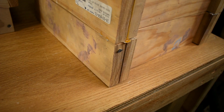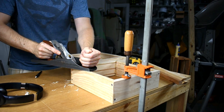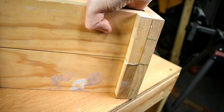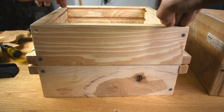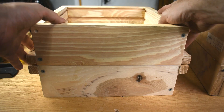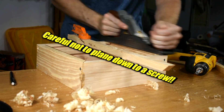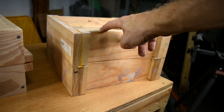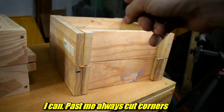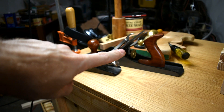Next, to fix the sitting-flat problem, I made sure the bottom flask would sit flush on the table — just adjusted it with the hand plane. Then I did the same thing to make sure the fit between the two flasks was better. Not only does it not rock on the table in either direction, the top doesn't rock on the bottom either — they fit perfect. I had to do this at the building stage, because as soon as you use it, sand gets embedded in the wood and you can't go back and fix it.